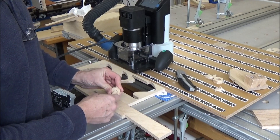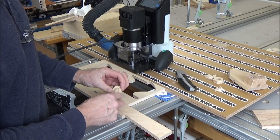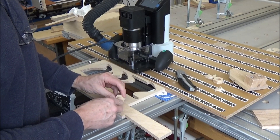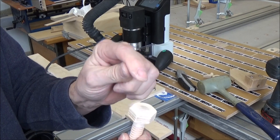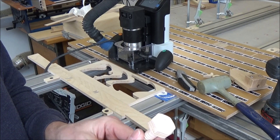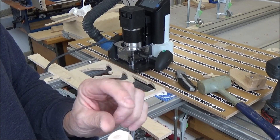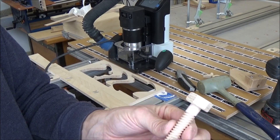This one is a little bit small, which is okay. I'd rather it be small than too big. So I'm going to take this and massage this end with some sandpaper to get a nice fit here. Very little sanding. This bolt was ten thousandths oversized — I could have compensated for that with my shaper, but I didn't measure this before I cut my piece. But this just took very little sanding to get it started. Then you can see the result — that is a friction fit. No glue. That's going to work out great.